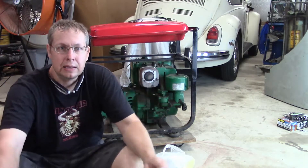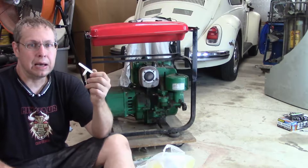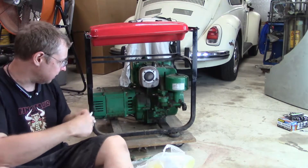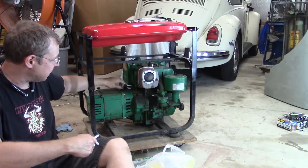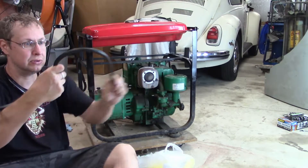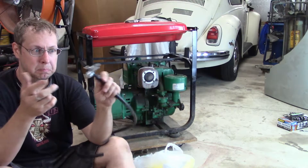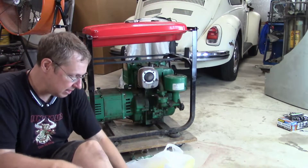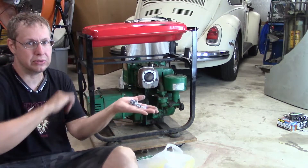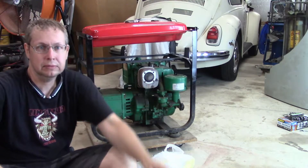I can actually use both tanks and not wake up every hour to fill this generator. I didn't bother to go out and buy an actual brass fitting, I just found this nylon one - it should work just fine. We're going to tap in, get rid of this old junk. This new fuel line should be nice because it's not petrified. Got a bunch of fuel injection hose clamps to take up any slack since this hose is a little bit larger and not 30 years old.